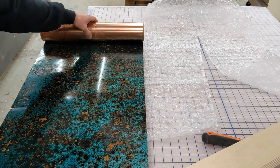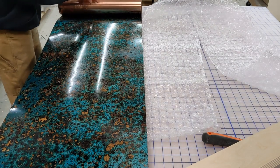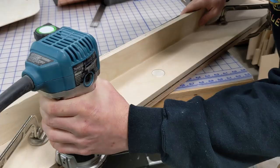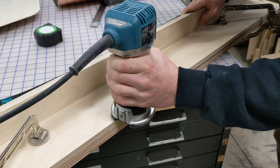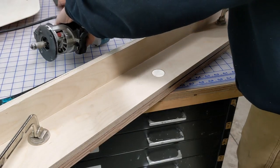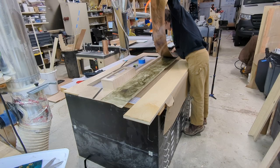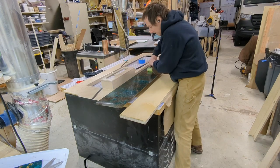Things started out really smoothly. The copper came in a roll — when I unrolled it, it was one eight-foot by 18-inch tall piece. I went ahead and cut it into the pieces I needed. The backsplash was just one long piece, and the back door panel is actually made out of two pieces, but the seam is below the countertop. I did notice one factory edge wasn't cut very well and had a little bit of fraying, but I could just run my router with a straight edge since copper is a very soft metal, so it trimmed up nicely. Applying the glue and setting it into place went really well too, and at this point I thought I was almost home — all I had to do was paint it and be done.